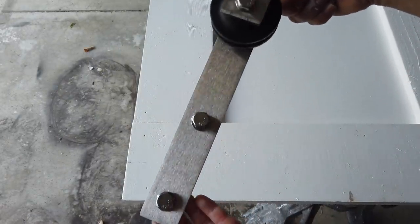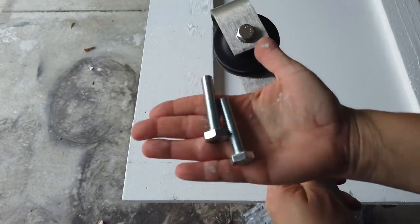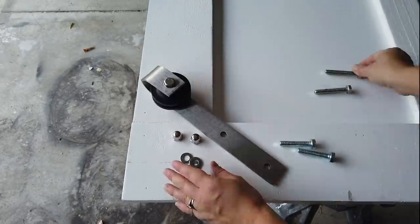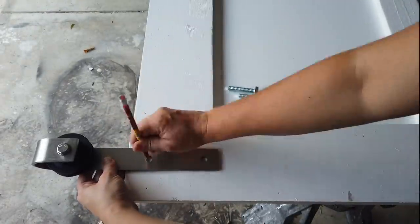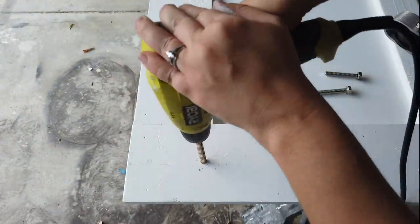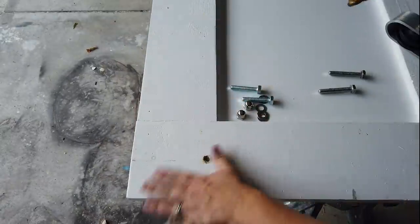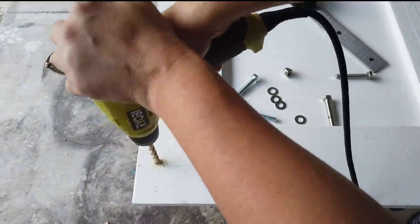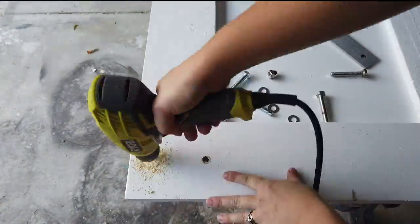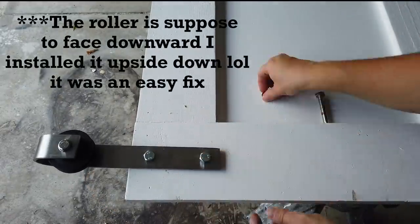To hang this door I'm using a kit I bought off Amazon — I'll link it below in the description. It came with everything you need to hang a barn door. I'm working with the rollers right now; those sit on the track and you get 2 of them, installed on each side at the top of the door. The bolts that came with the kit were too long for my door since mine isn't as thick as a store-bought door, so I went to Ace Hardware and got the right size for about $1.50. Then I drilled my holes and installed both rollers.